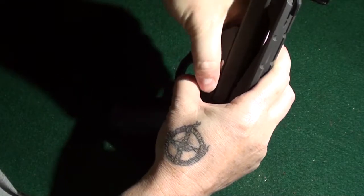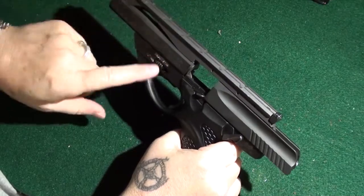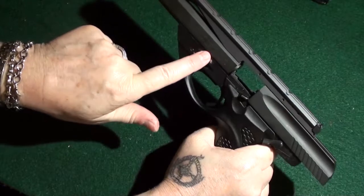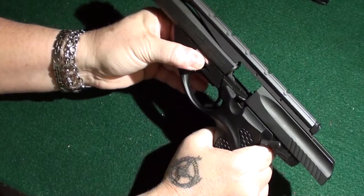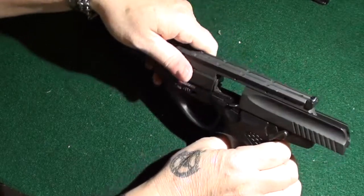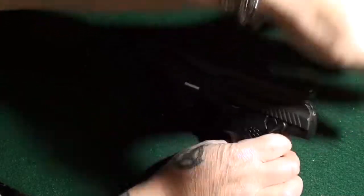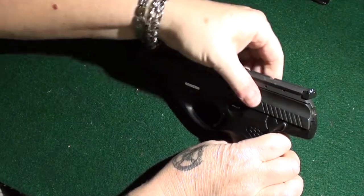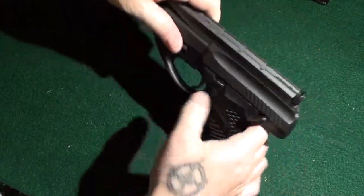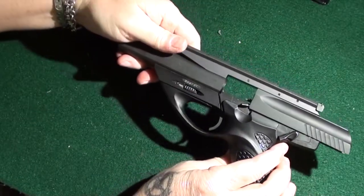You want to make sure you get it tightened good, because if you don't, this barrel is basically only hanging on by this right here and right here. So if you don't get this down tight, you're going to fire it and it's going to misfeed. If you are getting feeding problems, I would take a look at that. And then you pop it together like that — and there you go. It's all put back together.